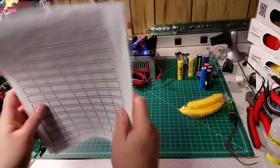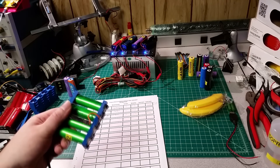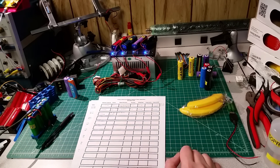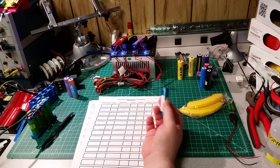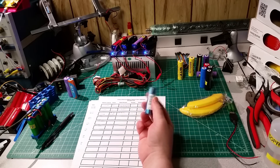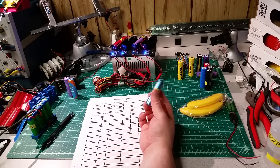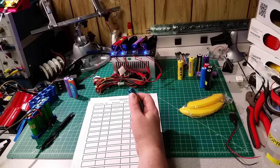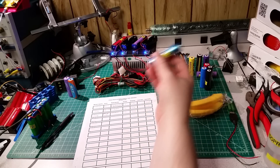Now, on to the laptop batteries. We've got the cells I pulled out of an old, very used Sony pack - they were coming up about 722 milliamp-hours each. I ended up putting those together in a pack. We've got another one here from a different laptop - I pulled a few cells out of a pack and this one read around 906 milliamp-hours, well below its original rating of 1,350 milliamp-hours. So it sits in line with a battery that's been through a long life of use. Laptop batteries really get hammered - people leave the laptop plugged in all the time, it's drained down constantly.